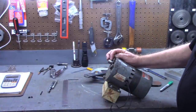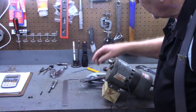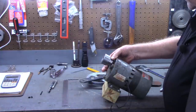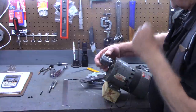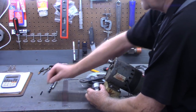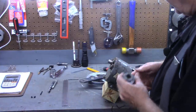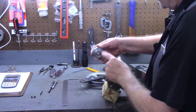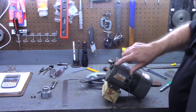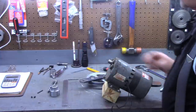As I said earlier in the video a couple times, this shaft on the motor is boogered up pretty good. It looks like this old piece might have twisted on it some, and I'm just not sure what got it, but this will fit over it pretty good. There's a little play in it. So what I'm going to do over at the mill is put two 1/4-20 grub screws or set screws at a 90 degree angle to each other. This also has a 5/32 hole in it. And I'm thinking after the two grub screws, I may very well drill this as well for a 5/32 spring pin and run that through our coupling and the motor shaft, just according to how much meat looks like it's left after I put the set screws in.